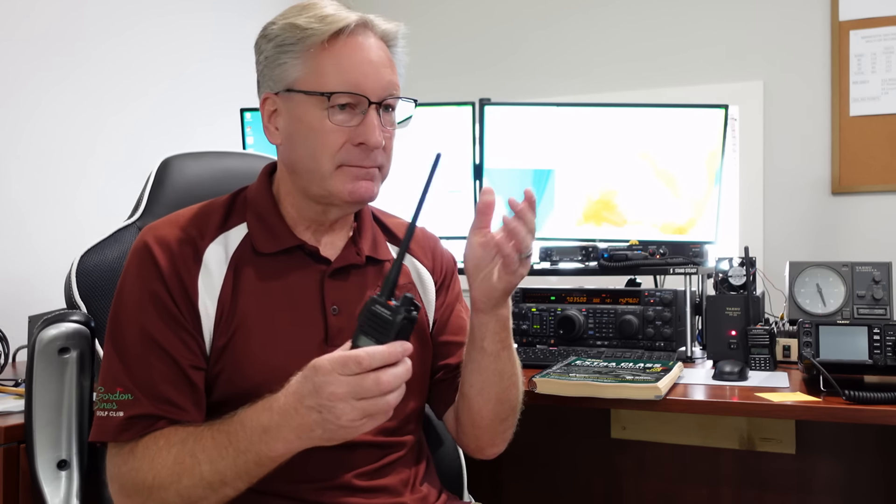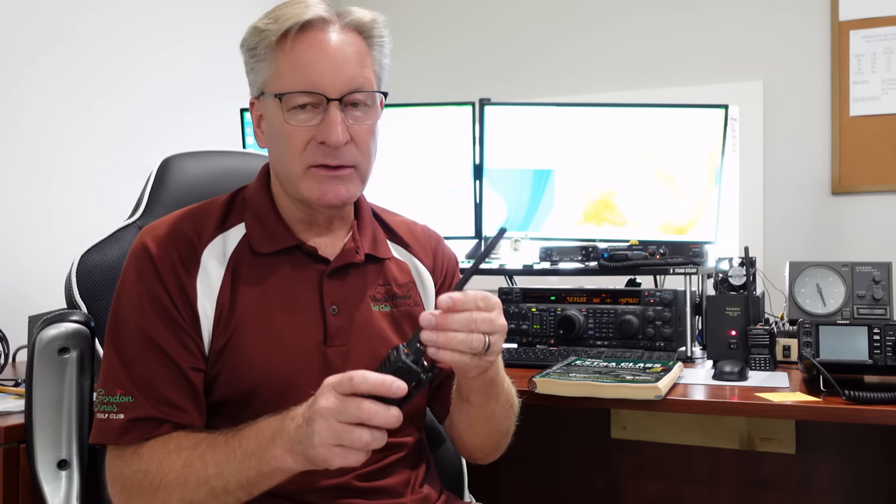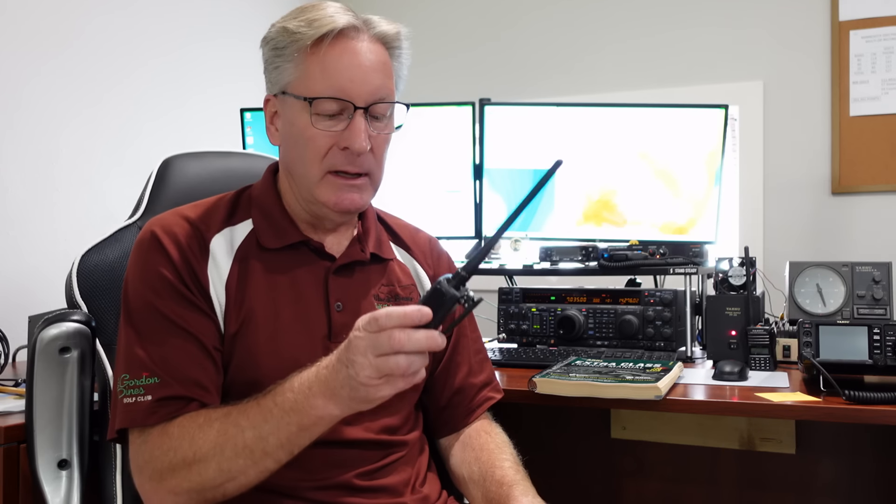Are a bunch on solar? Maybe some are, but most probably are not. So if the grid goes down and the repeater's down, now you're back to talking from this radio to that radio simplex — 5 watts, a small antenna, maybe up to 5 miles. You could hook it into a larger antenna and get a bit more range. But these are not going to get you any regional news or very far. Five miles doesn't get you far. Talk to a relative 10, 20, or 50 miles away? All of a sudden you're cut off. You've got to think through how to communicate further out.